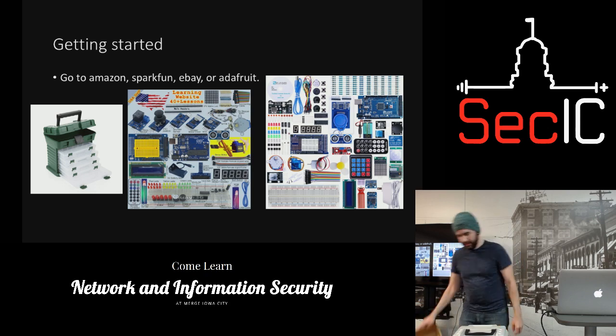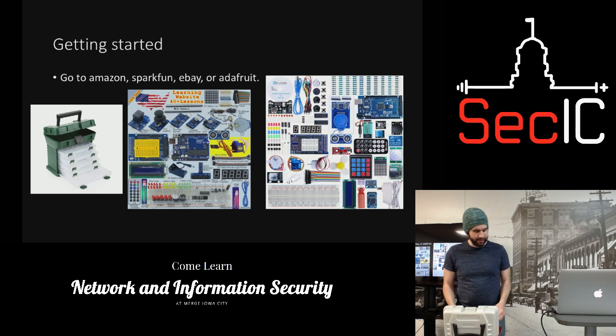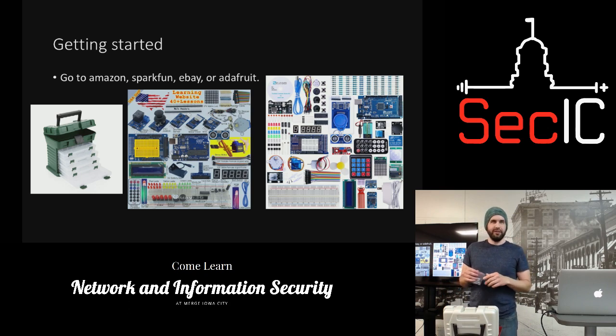These cost around ten dollars for a four-pack, so they're kind of pricey, but they're the ones to use — you can also order them from China. They're addressable, running on a bus — so it's a shared connection but you can still control each individual one. These are the ones where you can turn on each individual LED if you want.